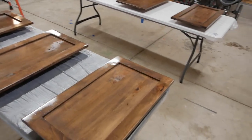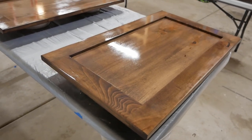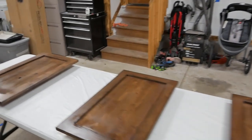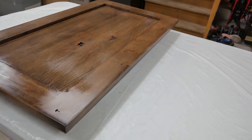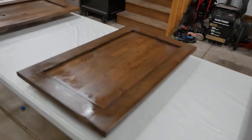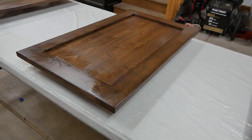So that's the first coat done. Everything got a 50% overlap with each pass. I laid a pretty wet coat on — nothing too crazy. When it's still wet you can see what looks like a little bit of bubbles, but coming over to the ones that are already drying, that stuff pretty much clears up. You can come back with a little bit of 400 grit sandpaper between coats — I'm going to put two coats on. I might not even need any sandpaper because it does lay down really smooth using a gun like that. We'll see once they dry and then we'll do a second coat.